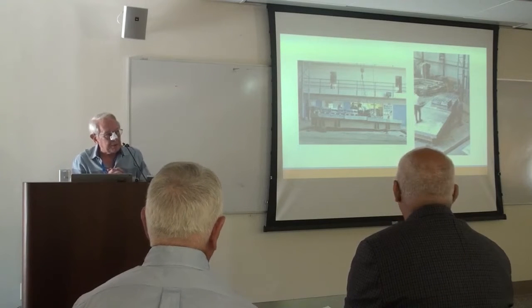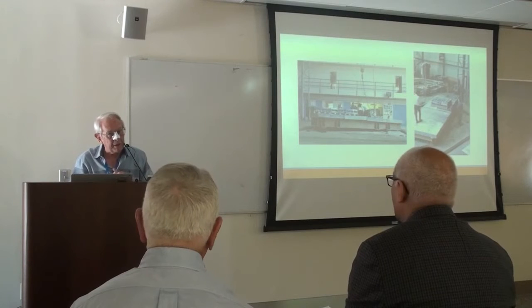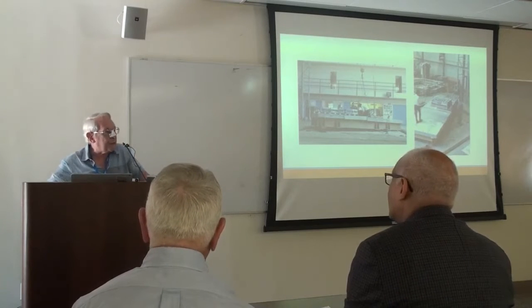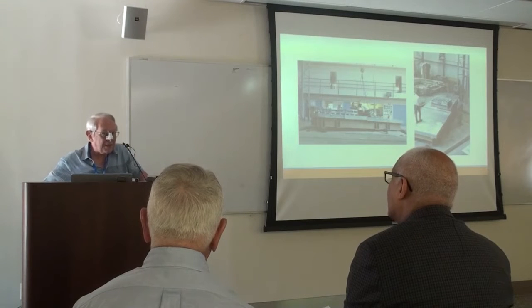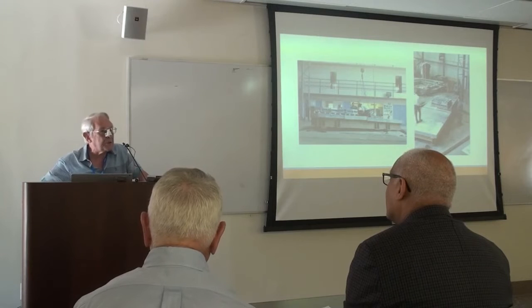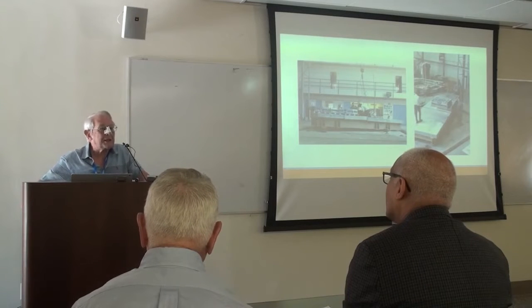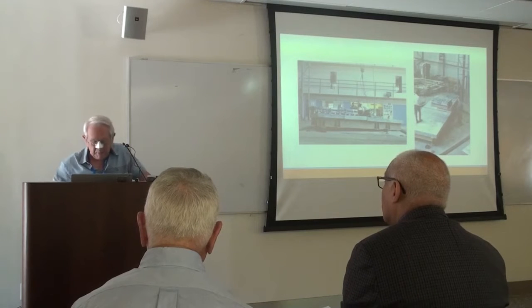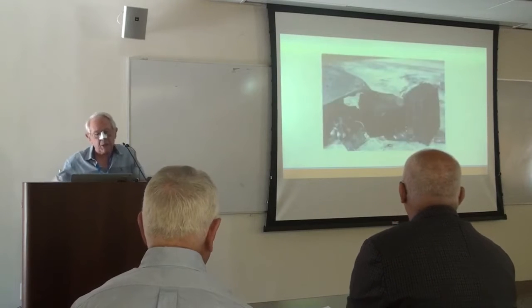So what had happened, lesson number one, was that these isolators had been cold vulcanized together, not hot vulcanized. So the bonding between the layers and the internal steel shims was inadequate. And under sustained load, it crept and came apart. So this is one of them here.